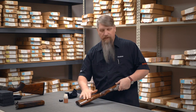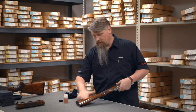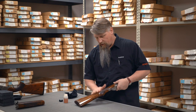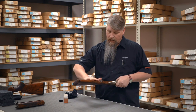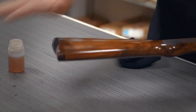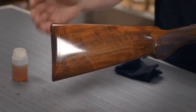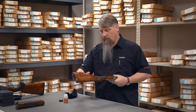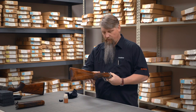I of course put it on perfectly the first time, but I'd rather you see the ease with which it is to apply this material. Now once I've got all of the surface covered and my light thin coat how I want it, I'm going to need to let this set aside and cure. I would recommend no less than 12 hours cure time between coats. 24 is better.